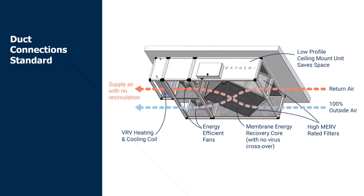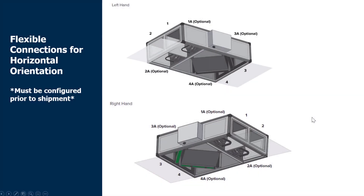For the standard duct connections on the Nova, the main thing to remember is that the outside air and the return air must be on the same side of the unit. You'll see here on the right we have the return air on the top going through the unit and the outside air coming in on the same side. We have this because of our stacked fan design — the two ECM fans are on top of each other — to keep it as compact as possible. A lot of our competitors have the return air and outside air on opposite ends. These are two horizontal images: a left hand and a right hand. The fan side is what you notice for the left hand and right hand, as well as the access section — when you're facing the access section, that's how you can tell if it's a left hand or right hand.